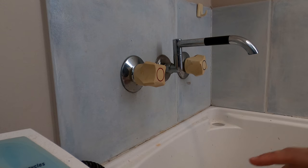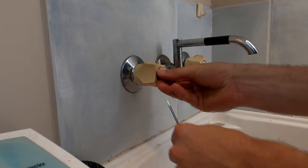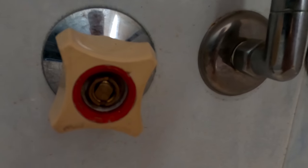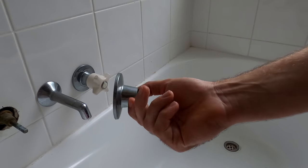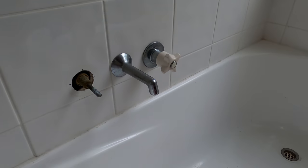Some taps look like this with a plastic cover on. You just got to find a little slot, use your screwdriver, and pop that cap off. Under that there's just a nut to undo — in my case, a half-inch nut. So that spindle cover just popped off — that's the old one. Sometimes they screw on and you might need your cloth and your multi-grips just to undo them and get them off.